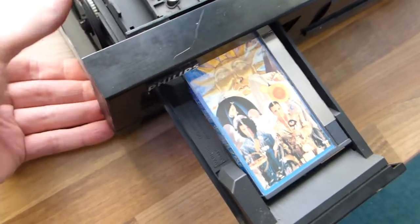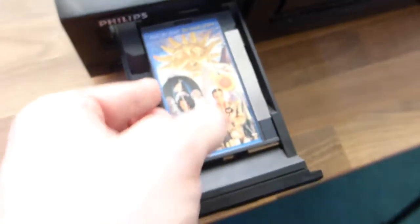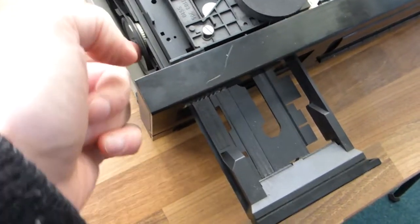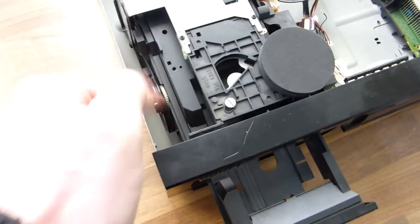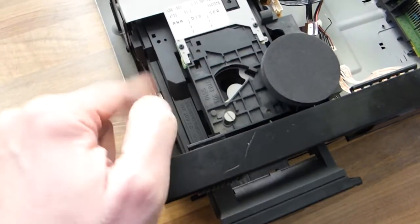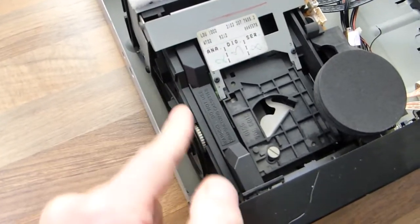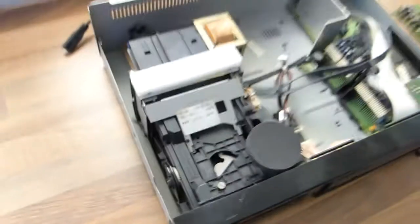It first lifts the cassette up and then it ejects the drawer, and it's all done by that wheel that I'm turning with my thumb. And when this belt is old and loose, the drawer has too much friction, and it just won't grab the belt, so the drawer just doesn't open, and then there's an error displayed.